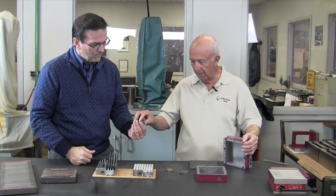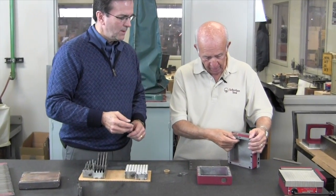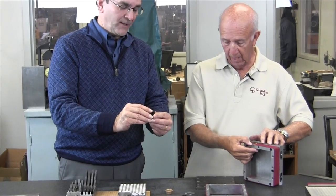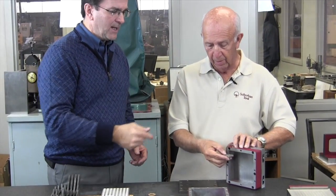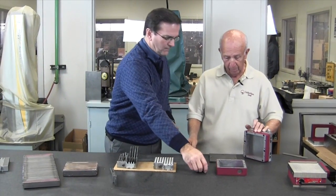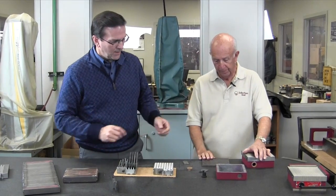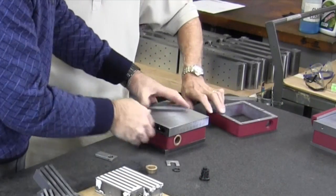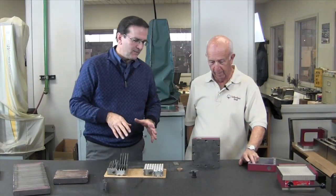We spot the special pin through the hole to get the best possible shut-off and turn-on. The cam goes on the magnet pack, that whole assembly goes into the frame, and the link lines up so the special pin — which has a point instead of a flat end — goes through the cam hole. We give it a little tap with a hammer, then pull the link back out, drill it, and put it all back together. Finally, we put the bottom plate on, assemble it onto the underside, and put some sealant on to keep water out.